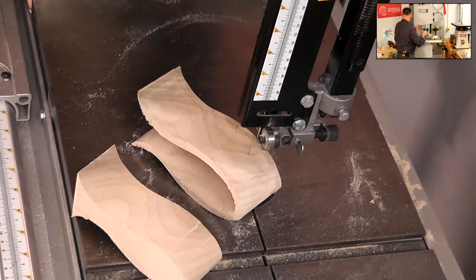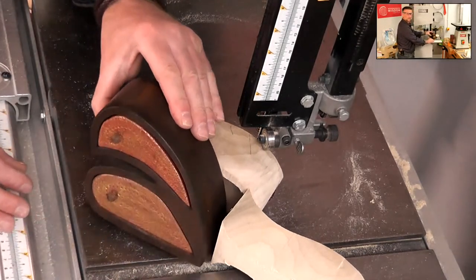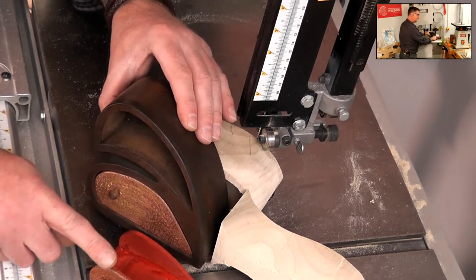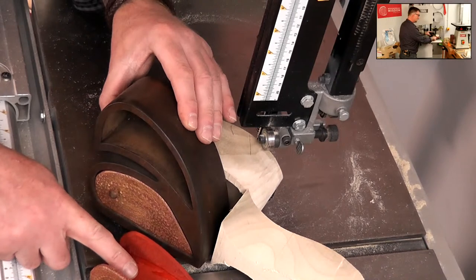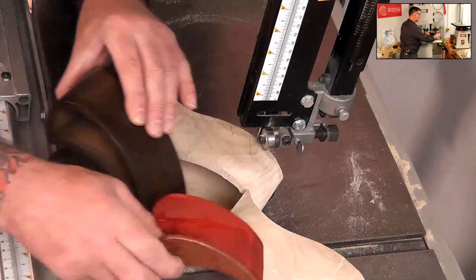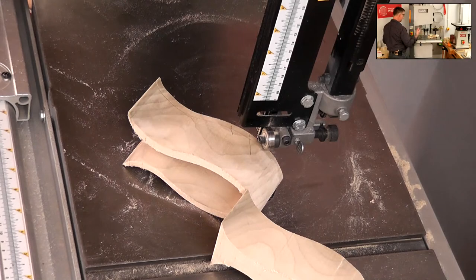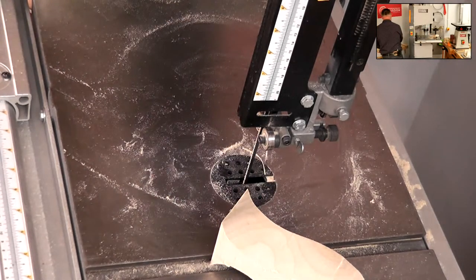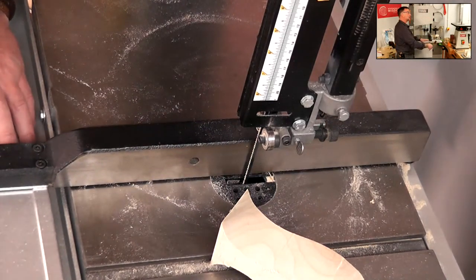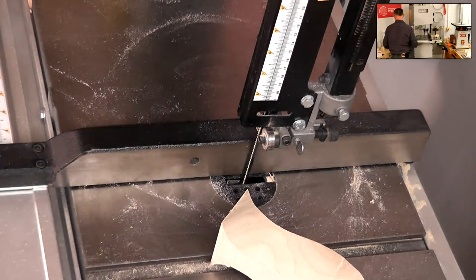So if I bring in one of the drawers from one of my other projects, this one for instance, well, let's pull that drawer out. We can see that we've got a back and a front and the middle chunk. Next job is to take off the back and the front from the middle section, the bit that you've just cut out of this hole. And again, we need to bring in the fence for this. Now, the fence distance usually for me on this is a little bit less than the 8 millimeters I used for the back. I tend to go about 6 mil.